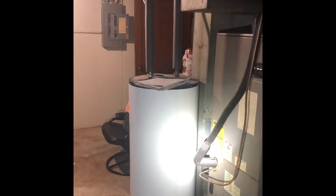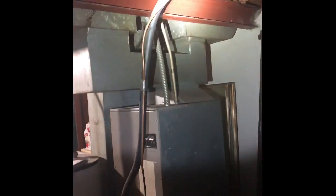The refrigerant lines — we'll just pressure test and flush those. We're gonna gain some extra length there by moving or turning the system, so we'll just pressure test and flush out the refrigerant lines.